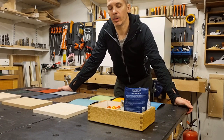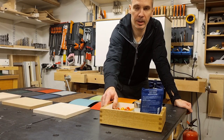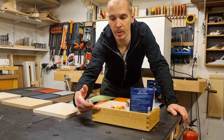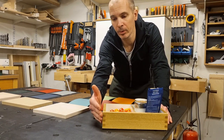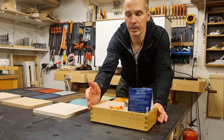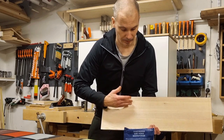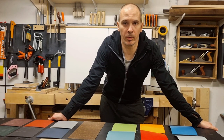With that in mind, how could I make those small storage boxes, which break both these rules — only laminated on the inside and onto solid wood? Well, the dimensions are really small, the wood movement in that width is almost zero, and the corner joints are very strong. So if there's a small cupping or warping, the corner joints will hold it together. But if the wood width goes up to about 20 cm, I would never apply these materials — the wood movement is just too big and you will get into problems.